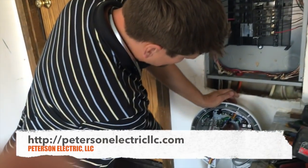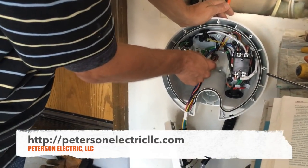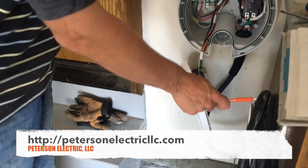You also want to make sure you get a bushing on here and slit your Romex right without shorting it out — without cutting into the wire, the conductor, the insulation. We went ahead and hung their cord right here as well.